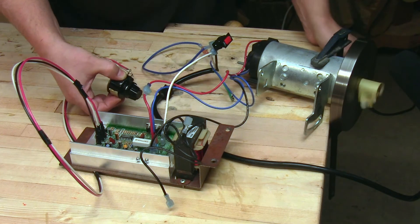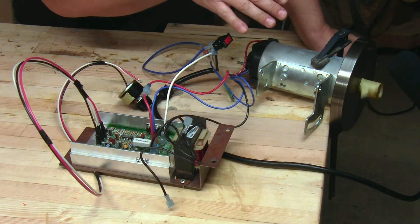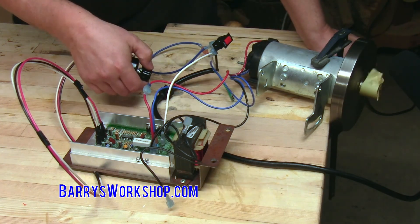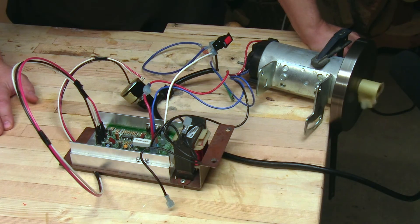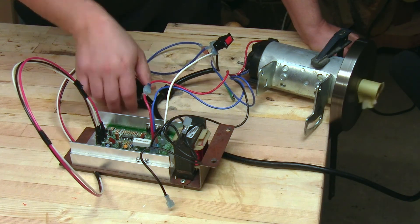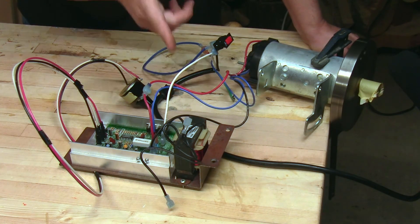I'm going to turn it back to a slower speed and let it find that new speed as the flywheel spins down. There were maybe two oscillations as it went from the medium speed to the slow speed. I'll put it back on the medium speed and do a little load test. I hear about two to three oscillations each time as it settles in on that new speed. It's definitely not as smooth as it is with the inductor in the circuit.